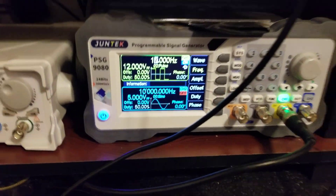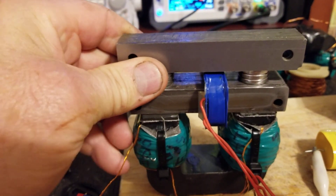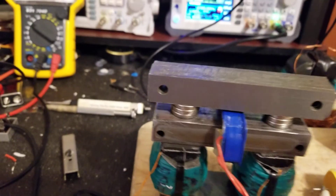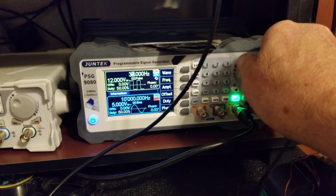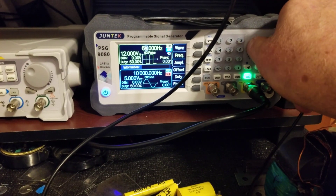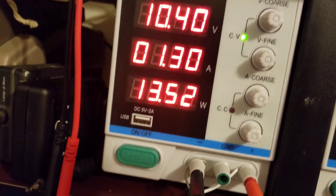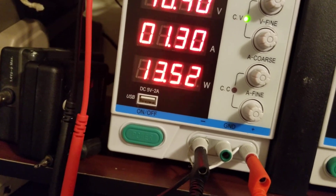All right, so I think we're doing seventeen hertz right now. But now you can pick the core up — so the magnetic circuit is being switched by this coil, and we're getting this back and forth through the U-core. I'm going to speed this up — it's very responsive. I'm going to run it right there at sixty. This is our amp draw: 10.4 volts at 1.3 amps, and again roughly thirteen and a half watts going in.